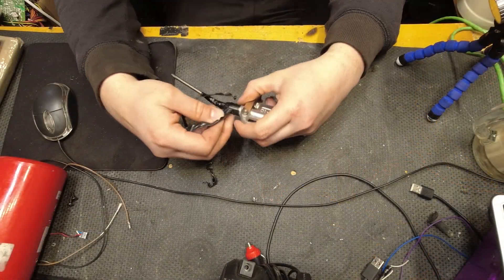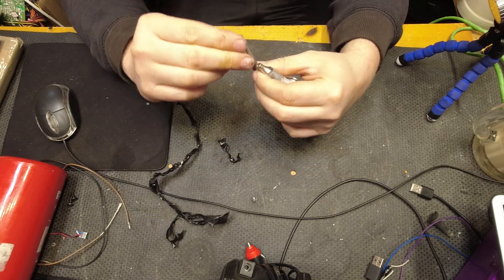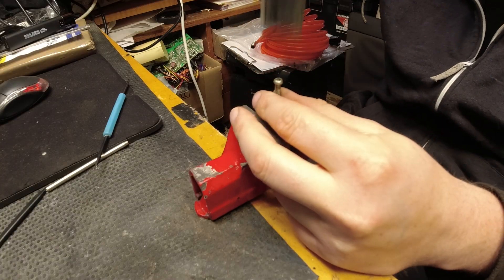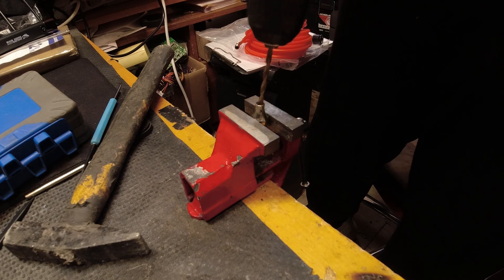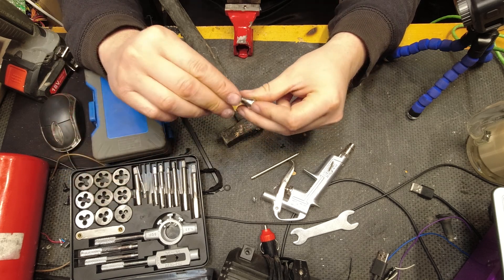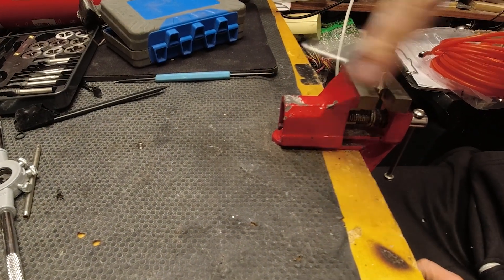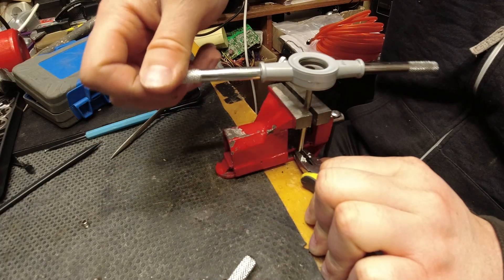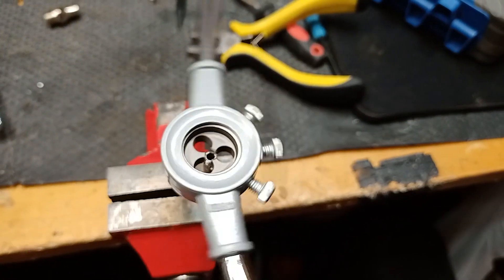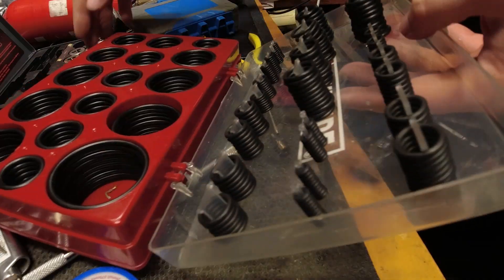Next, I will try to fix a few things so that I have something to connect to it, like this air blow gun. My previous repair with tape didn't work, so I decided to punch out the broken part and solder the two parts together. Since I didn't manage to break it out without risking damage, I tried to drill through the broken part. Then I realized that the top was screwed in before, so I decided to screw it in instead of soldering. I cleaned the threads on the main part and tapped the threads on the tubular part, and just like that that part was fixed. I added some teflon tape and changed the rubber seal just in case.